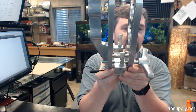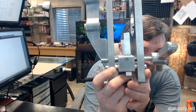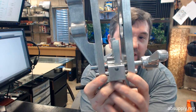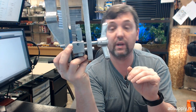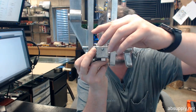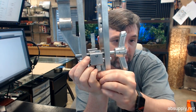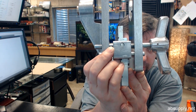You're going to have 2 feeler gauges, one here and one here, and that's how you set the back set. Real simple. Just push that spring-loaded tab on the end and set the back set. It's currently set for 3 3/4, which I know is unusual, but it's not. You'll run into 3 3/4 in hospital installations with push-pull latches, and 5-inch. So you're going to depress that, and then your feeler gauge is simply going to snap into whatever you're doing. Set to 2 3/4 right now.